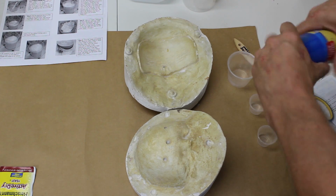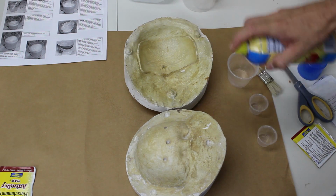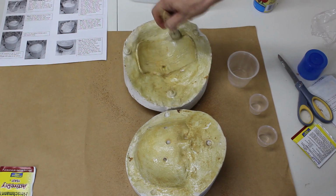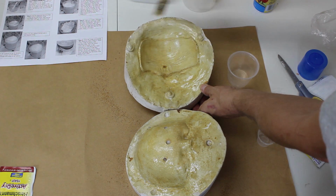The first step in the process is to release your mold. The mold we're using is one of my stock 4-head molds. I have achieved the best results in a closed mold, but you can spatulate this material into an open mold. However, your results will not be as controlled. The best mold release I've found is simply cooking spray.